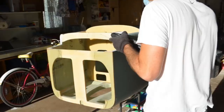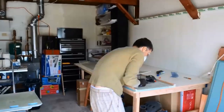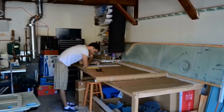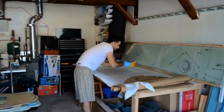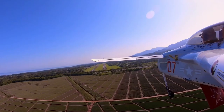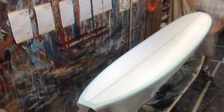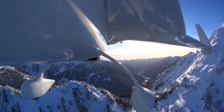The Long-EZ uses Rutan's moldless foam core construction method, a brilliant, simple way to optimize shape by cutting or hot wiring out of a profile of blocks of high-density polyfoam, sanding it to exact dimensions, and laying on fiberglass and epoxy over the foam, as is done with surfboards. The result is a light, sleek airframe giving very efficient aerodynamics.